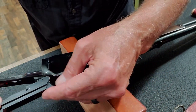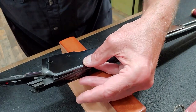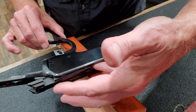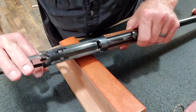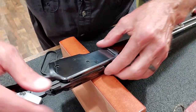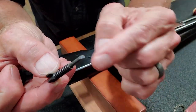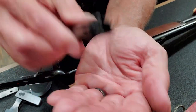Let's go about this and put this back together again. Controlling the ejector with my little finger, take the bolt into about this position, take the finger lever with the locking bolts and put it in. It naturally goes into the slot where it needs to be, we close the finger lever. What happened there — just to show you how critical it is — even though I was trying really hard, the ejector came out and that little collar is not on the ejector. The collar is captured right here inside the breech bolt. That's how easy it is to lose everything.